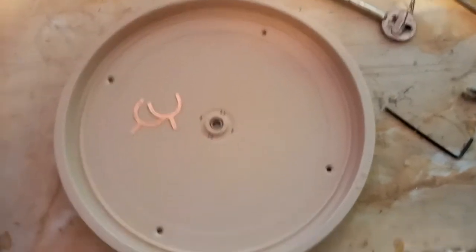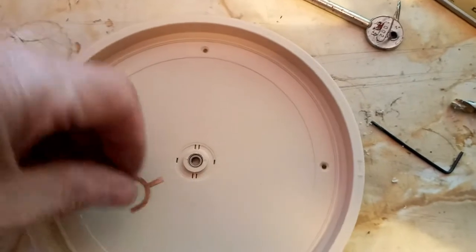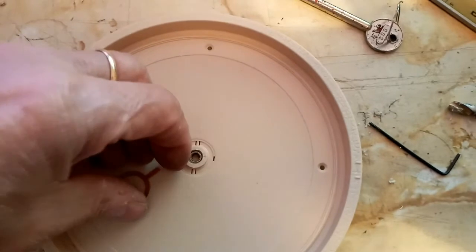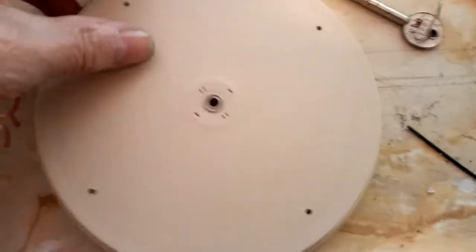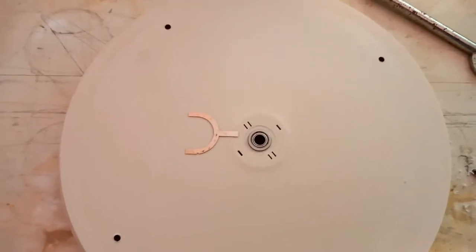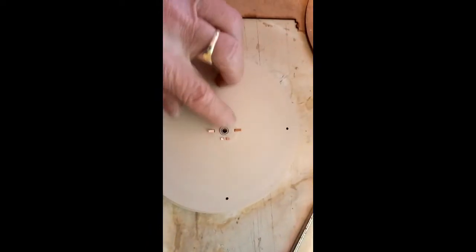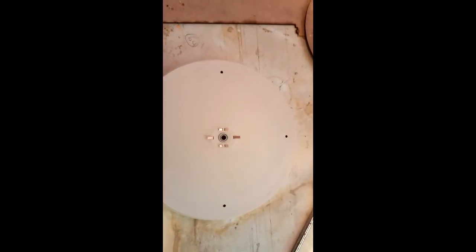Right, that's my four holes done now in countersink. That's the only mods to the grey fawn coloured base unit. Now would be a good time to turn over and to fit the copper pickup strips. This is as per Peco instructions. Right, that's my two copper strips fitted, and tabs bent over, and the big tabs left slightly proud, ready to solder the wires on at a later date.